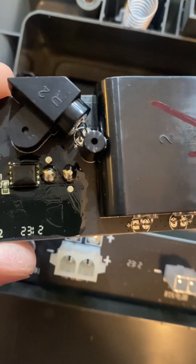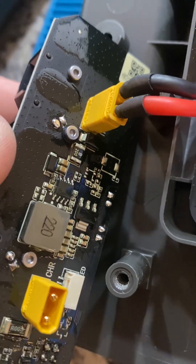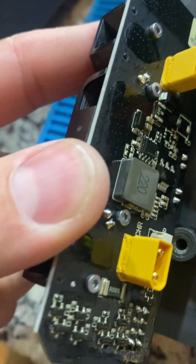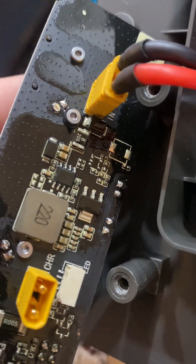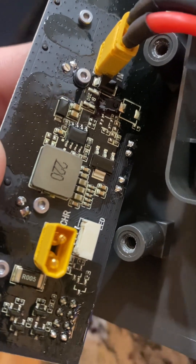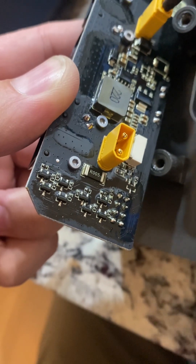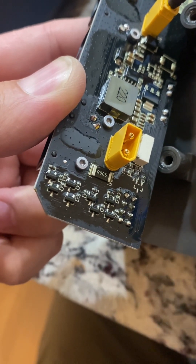I'm not seeing much power regulation circuitry — it looks like once power comes in, it's delivering power directly, though I might be wrong. We do have a possible shunt resistor, big ceramic capacitors, and a voltage regulator — I'm guessing that's taking 24 volts down to 3 volts for the microprocessor and LEDs. We also have some big resistors and what appears to be 8 MOSFETs.